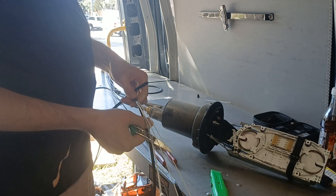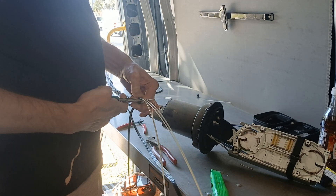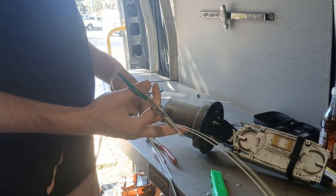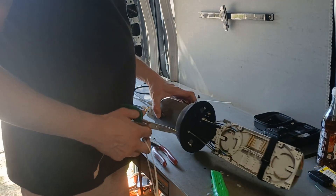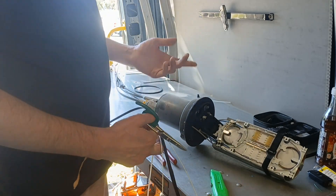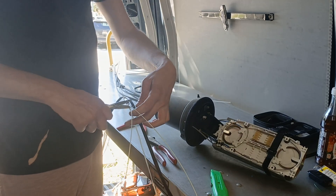I'm going to take these jackets off. This is a FOSC that is in a ground case. I pretty much don't utilize my strength members because the A tray is kind of a pain in the butt to build, and also once this goes back in the ground it's not like it's moving around like it's on a pole.